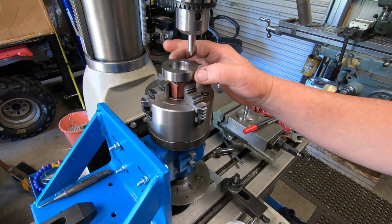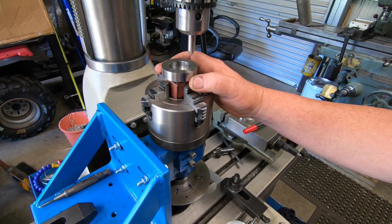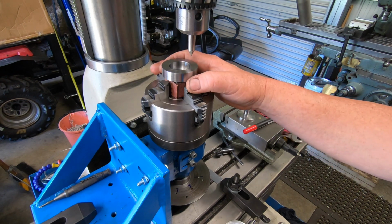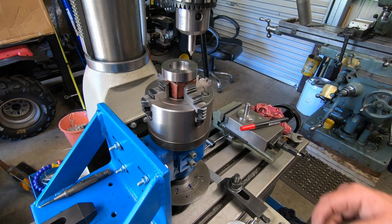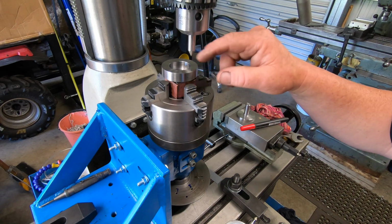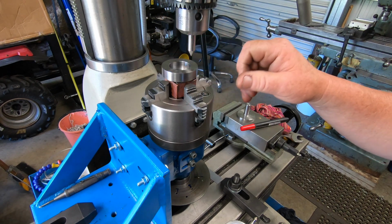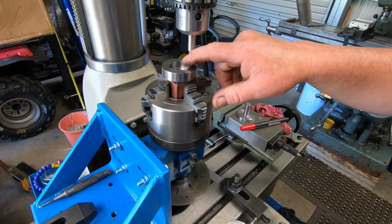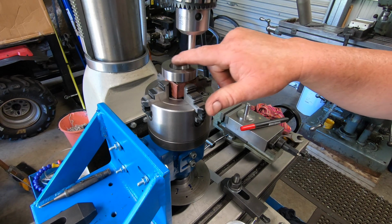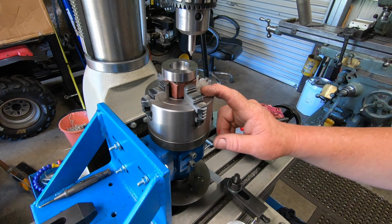Now these call for a fairly good clearance hole, which it has to be for when you go to put the tool on centre. So anyway, hope you can work out what I mean there. I'm having trouble working myself out. So I'm going to spot these, then I'll go around, spot them, double check them, and then yeah, we'll drill them. I'm pretty happy the way that sleeve come up. It come out better than what I expected. With a little chamfer there, you can't even notice it has got a sleeve in there.